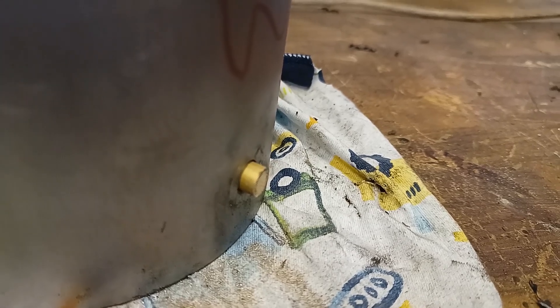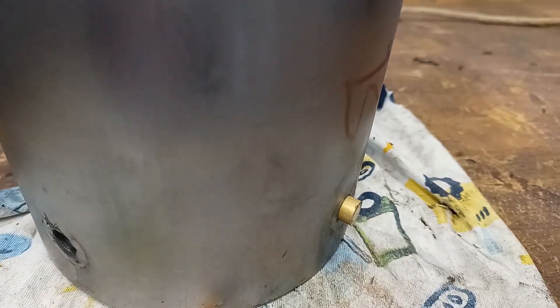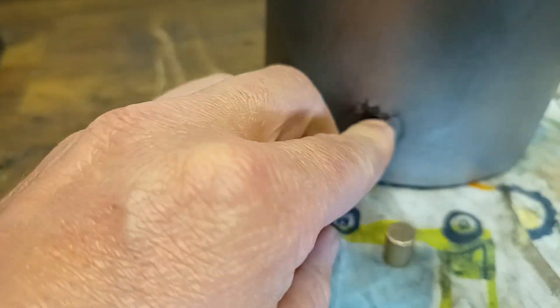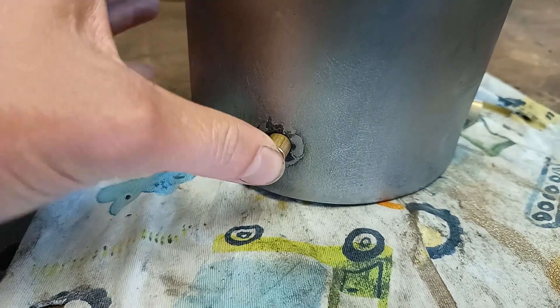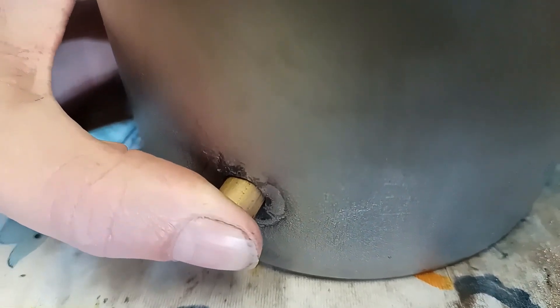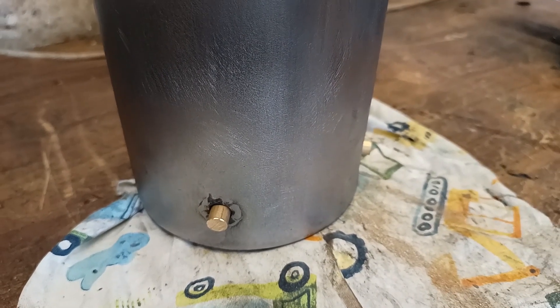This is the new piston slide made out of brass. The bottom slide is solid — somebody suggested this in the comments and I think they're probably right. The ones on the top and sides have a short little spring that pops into the hole, with another little brass piece that compresses in. That gives a nice even pressure against the side of the cylinder to keep it central and stop it bouncing around and making noise. How long they'll actually last, there's only one way to find out.